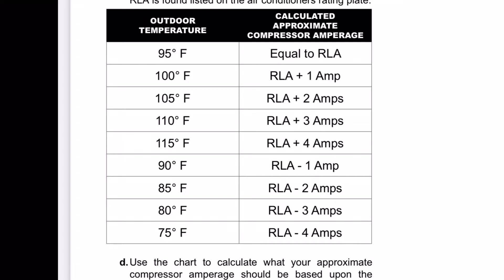You should let it run for a half hour before doing that test. More importantly, if you have a low amperage, that's an indication you've lost refrigerant — I see that scenario more often than this one.